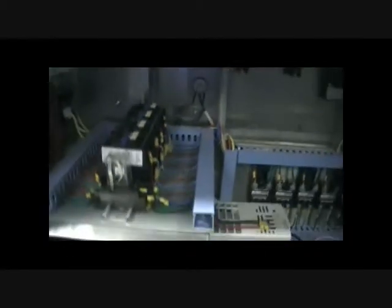Down here we have how the heat gets to the heaters on the jaws, and basically you have carbon brushes that run around on brass rings. Now after a long period of time these will get dirty, so just to wipe them with a cloth maybe every 4 or 5 weeks or something will help to keep the machine running nice and smoothly.